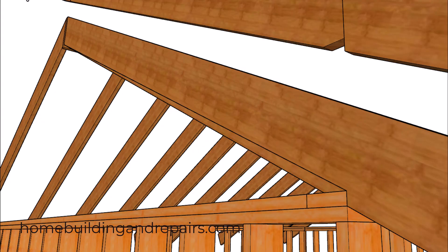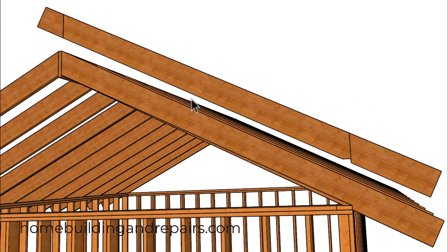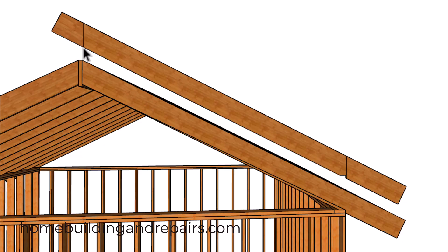Now that we've got that out of the way, let's take a look at the measurements that will work. That will be from the plumb cut to the plumb cut. So you can go from the top here to the top here, or the bottom here to the bottom here. But again, you cannot go from the top of this to this point or this point. You can measure up or measure this distance here and transfer it to this point here.